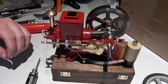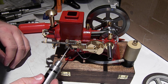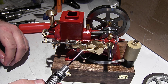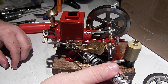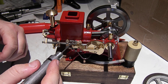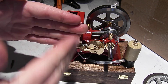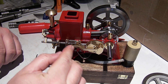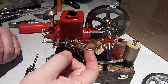I got so busy with this I forgot to check my recording time and my camera stopped recording because it's got that 30-minute stop on it. Anyhow, the solution I'm going to look at is changing this pawl shape so that it's got an angle for the detent so it's going to lock in a bit better, because currently when it goes in it angles like that, and so when the push rod is resting against it, it wedges out and pushes the pawl out. That means it takes more pressure to keep the pawl in place, so the engine has to run faster to get the pressure off of the governor.